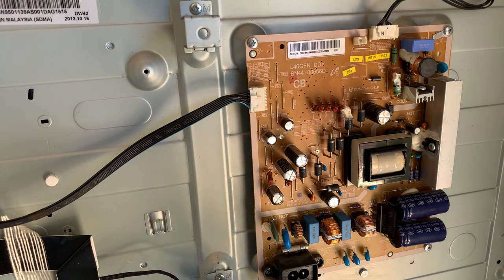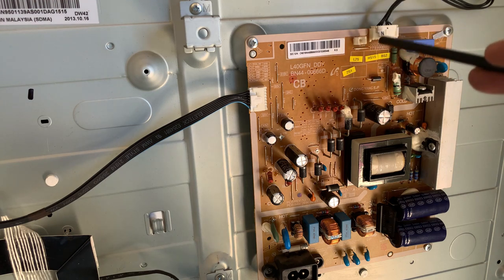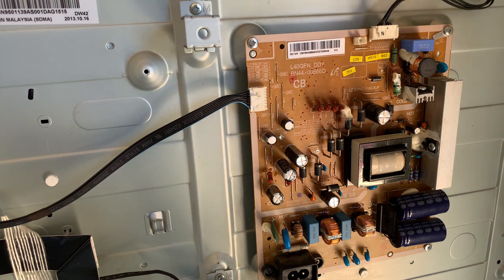So what I'm going to do, I'm going to hook my multimeter negative up to here, and we're going to probe around here so we can see, is this voltage going to the LEDs? Have we got supply to the LEDs? And is it coming back? Because that MOSFET will actually switch through that current sense resistor. One side of it will go to whatever op amp is measuring or whatever chip they're using. The other side will go to ground. So if we're getting a voltage on one of these legs, then we know that that is switching through. And if we know the voltage is going out, then what we know is the LEDs themselves are stuffed. They are maybe open circuit or whatever. In which case, if the LEDs are open circuit, we will not get a voltage here. But we will know what this transistor or MOSFET is doing. So let's have a look at that.